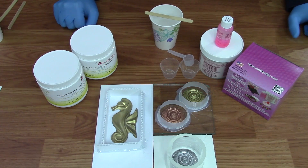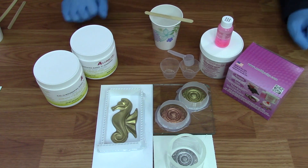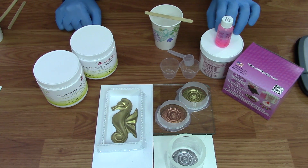In this video segment we're going to review different ways to mix silicone rubber. There are basically three ways we can mix silicone rubber: one is by volume using the included containers when you buy smaller kits, by weight using a scale, or by dumping the entire bottle of catalyst in with the base at one time and mixing the entire container.